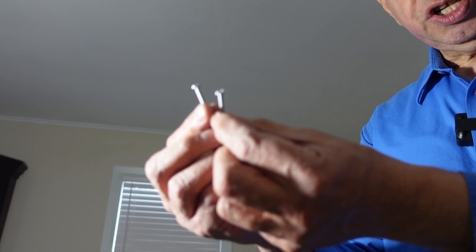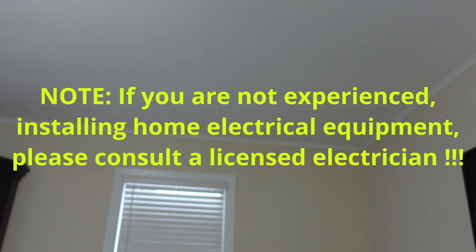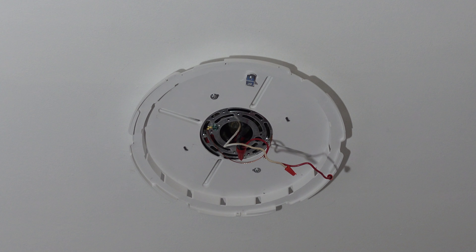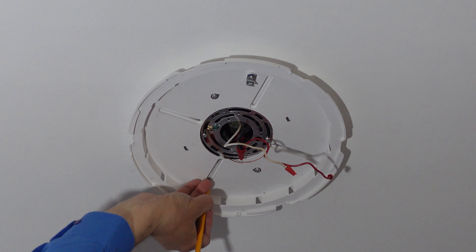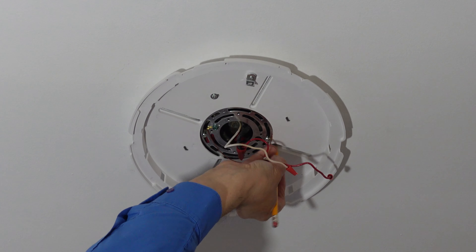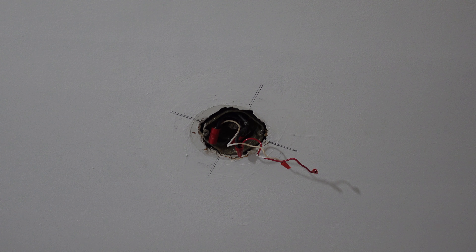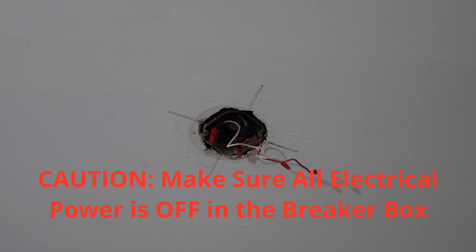The first thing we have to do is install the two screws that came with it to connect the base of the fan up to the holder in the ceiling. I got it up there — it took a little effort, I had to get somebody to help me, a helper to give me a third hand and hold a light. Now I'm going to mark it and then get ready to drill some holes for the anchors. It's got slots — I'll just follow the slots. Now I have to take it back down again. I got it off and you can see the marks on the ceiling from the pencil. I'm going to use just two anchors for now to give it some extra strength up to the ceiling.